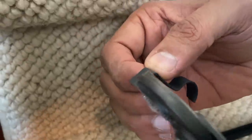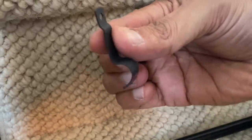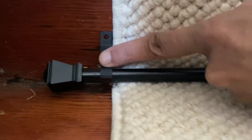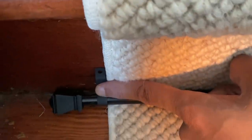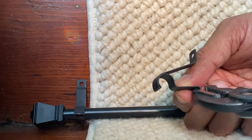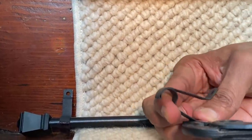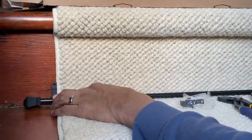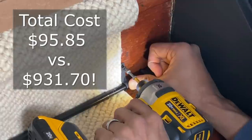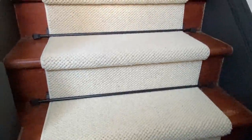I really only needed to use one screw as it was still enough to anchor and hold the rod in securely. All we've done is used pliers to cut it and then vice grips to bend it back, making it nice and flat and flush to the stair. Because the staircase is so old and very steep, and modern stair risers and steps are bigger than they used to make back in the day, I wanted to eliminate bulk while still having it safely secured. This is a great way to add aesthetics and a little bit of contrast, and I love the antiquity look of the stair riser rod.